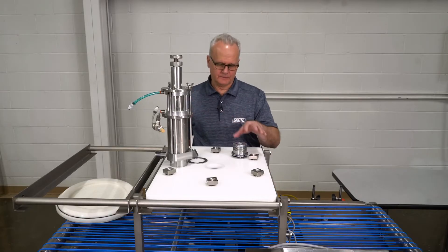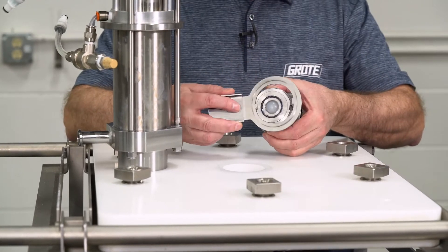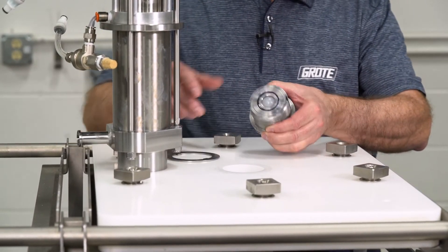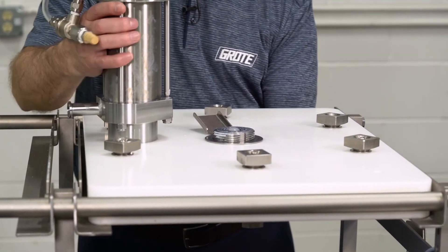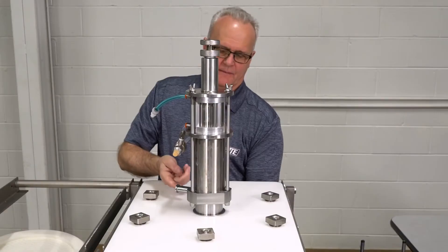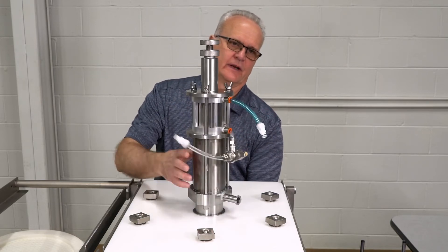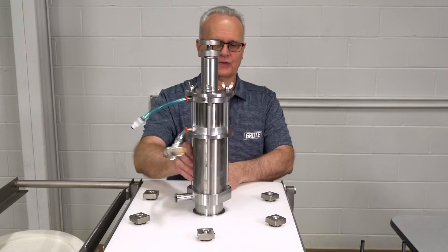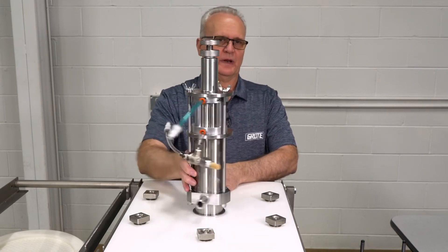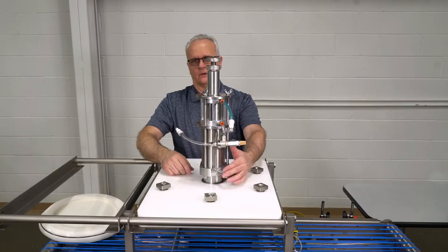So now we're going to install the sauce pump to the sauce head. You notice here we have a key. As this protrudes up through there, there are two slots and the key goes on in that fashion. You're going to reach underneath and push that up through, lay your key on, take your pump, and set it up on top. Now keep pressure of the discharge valve assembly against the pump, and as you turn it, it should grab that part. Once you've got that part caught, turn this all the way up. At that point it starts to get tight — look underneath and check this o-ring to make sure you're not cutting it. Then orientate the pump whichever way you need it and make your connection to your inlet.